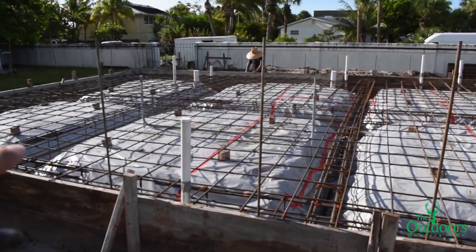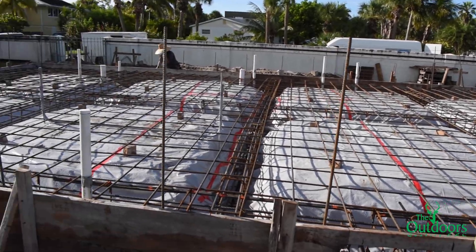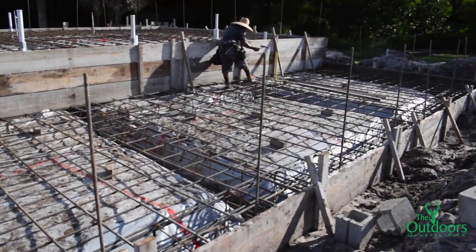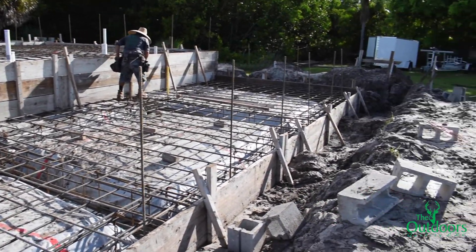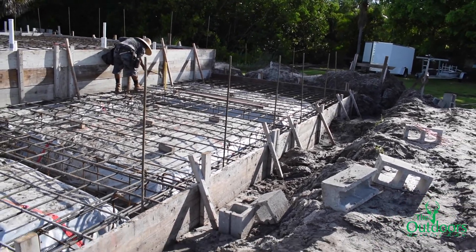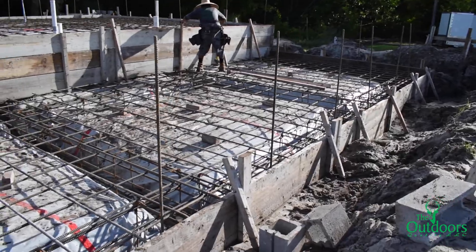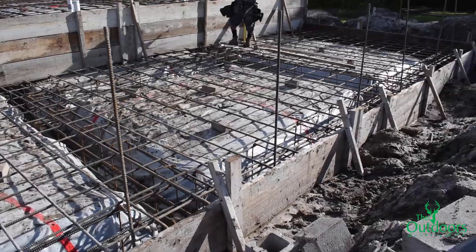This slab right here is going to be poured at six inches, so that's S1. Now S2 is going to be over here on this other side. This section right here is our S2, which is our slab number two. This one goes at eight inches deep at 3,500 psi concrete slab with number five bars at 12 inches on center, reinforced with fiber mesh, and obviously we have to have our vapor barrier compacted with termite spray.